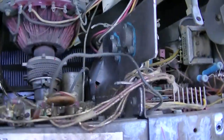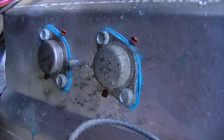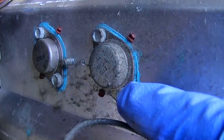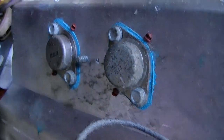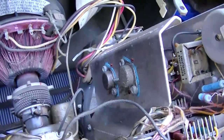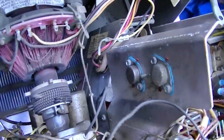And then through a 4700 microfarad capacitor into the yoke. These two TO-3 package transistors are the vertical output, and it looks like one of them has been changed. One is a Motorola part with a date code of 7513, and the other has a date code of 7605 and is an RCA part. I'd think everything in here would be branded RCA — they might be made by Motorola but I wouldn't expect them to be branded Motorola.